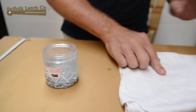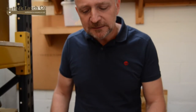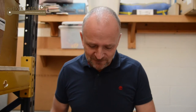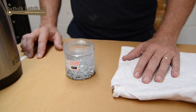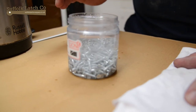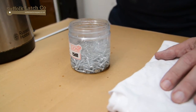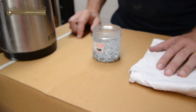Just leave it. Now what's important here is — I'm out here in my factory using it — it's going to give up a little bit of a smell, a bit like rotten eggs. So you don't want to be doing it in your house. Perhaps prepare it in the house but take it outside, because you don't want to stink the house out. That's going to require, depending on the thickness of the coating, pretty much half an hour or so. What will actually happen is the acid will gradually start attacking the zinc coating and it will start fizzing up. After a short while it will start getting a froth on top and then the screws will gradually get darker and darker the longer you leave it in there. I'm going to leave this now for half an hour.